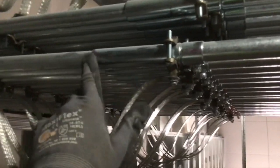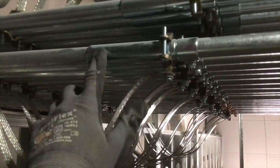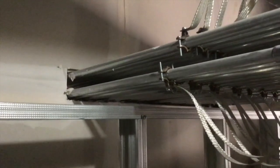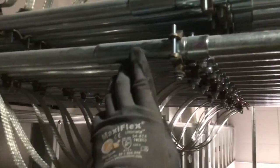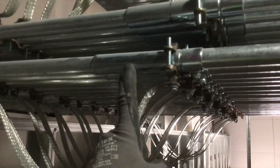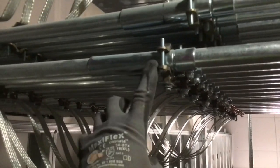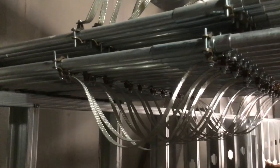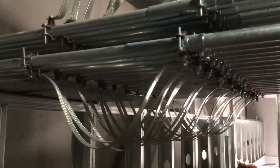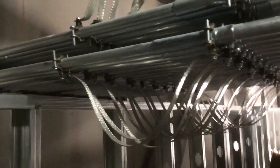On this end right here, there's nothing but a floating area for this pipe. As it expands and contracts through the expansion joint of the building, our EMT is sitting about right in here and has about two inches of travel to go this way or that way. As the building moves, the EMT will move, and we don't want any fittings to be popped out.